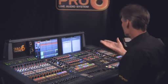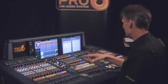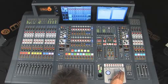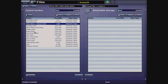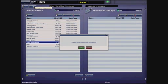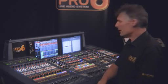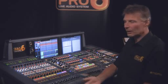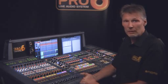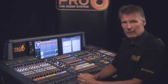If we want to export our new show to the USB key, the first thing we need to do is close it down. The reason we have to close the show file is a safety feature — because we can't export a currently active show file, it means if we were to suffer a power failure during the export, none of the data can become corrupted.